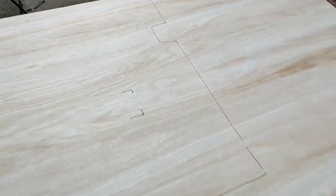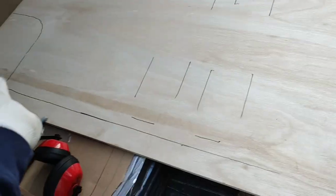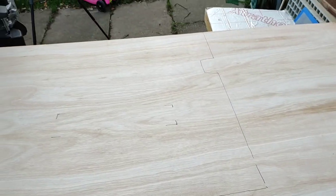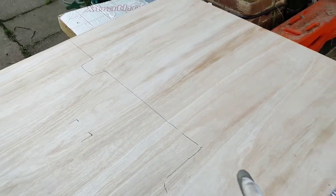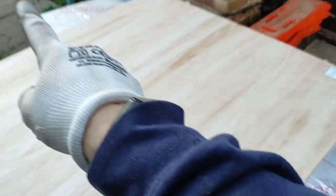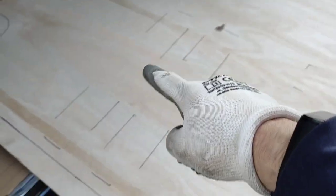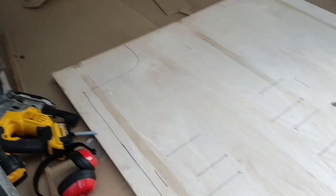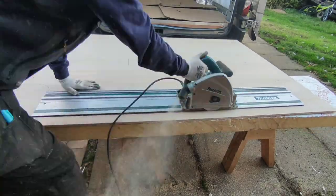I'm using the cardboard templates to mark out the plywood. I'm going to mark out the straight lines, and although I've run along these, I'm going to double check them with a straight edge and remark as necessary. For this one I don't need to re-mark — I'm just going to use my track saw to take that straight off. I'll use the template I've made for the rails for that bit, and then use the jigsaw for the little cutouts.